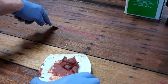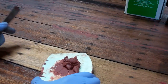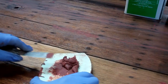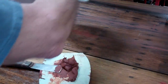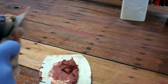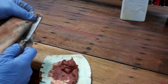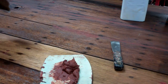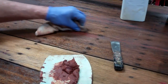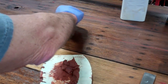Then go back and apply a second coat of this material. Your goal here is to drive it to the bottom of the seam — you don't want an airspace in between. We'll work a section as I have right here; I would normally continue for 10 feet or so. What I do continuously is keep my one-inch putty knife clean so that it slides. The seam compound tends to load up and then the surface of the knife becomes sticky and no longer slides. I also use 216 once I've done a section.